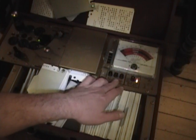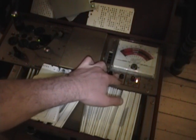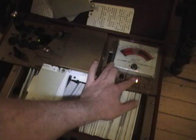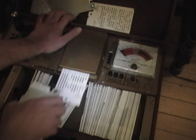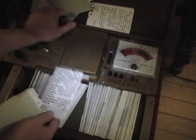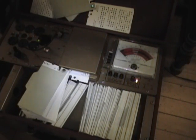All right, so no gas. Quality: one section, very strong. Check the other section. Wow. It's one of the best 6SN7s I've ever checked. I should have left that card in. I was thinking I would go through the cards for the 2 and 3 modes, but this tested so well with the first card, I'm not going to bother.